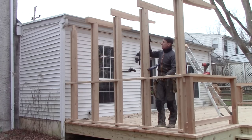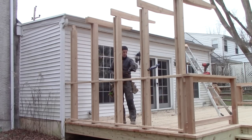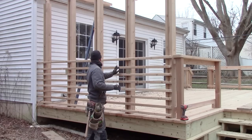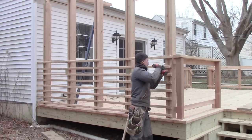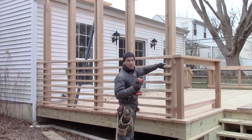I checked my posts for plumb before I started installing my screen, because you want to know if they're plumb before you've locked everything in place with your screen material. I checked this one — it had nudged itself out just a little bit. I took some clamps and squeezed them together, blew a few screws in here. I've got layout marks on here, and I've got blocks to help support the piece while I get it on the layout marks. But the punchline is I'm using layout marks and not blocks so I don't telegraph a mistake through the whole pattern.